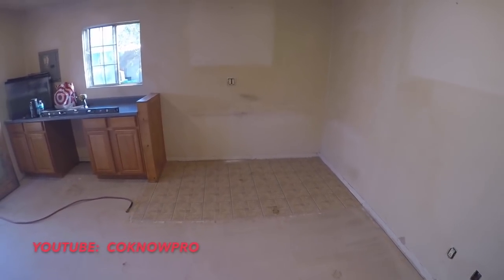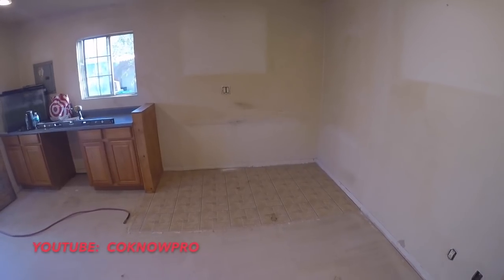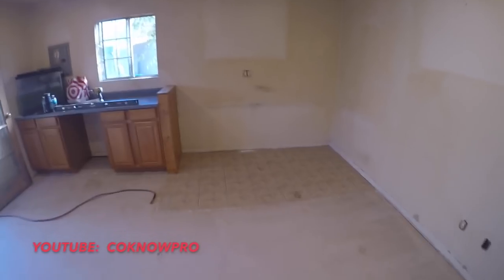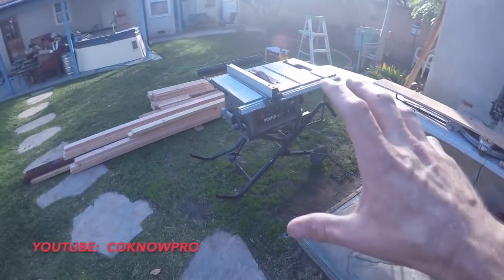And then on that back wall, we're going to be mounting the cedar dog-eared fence plank, butt jointed all up against the wall, with staggered joints. And then we're going to be framing it out with some really cool old school Doug fir that I salvaged from a house that I'm remodeling.